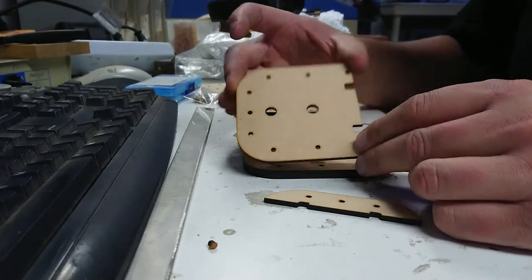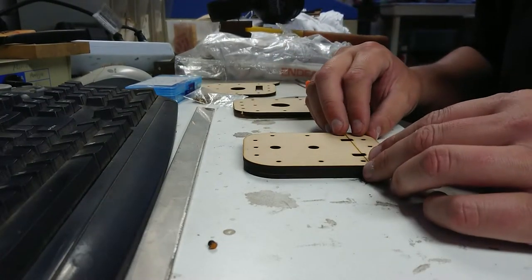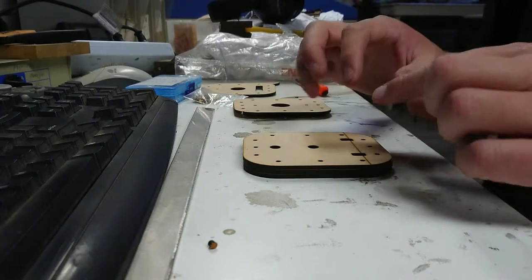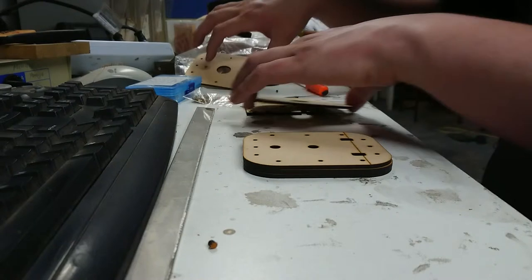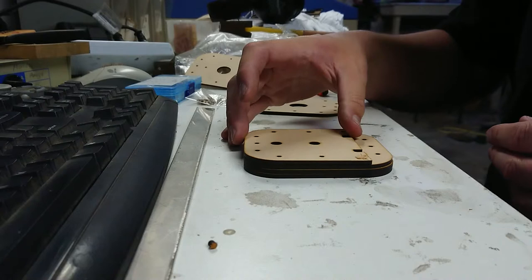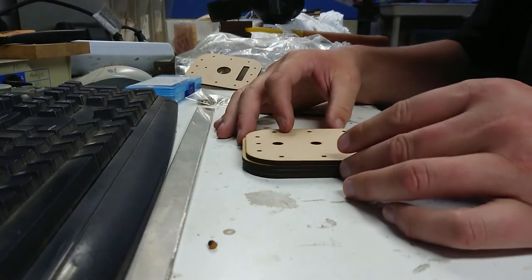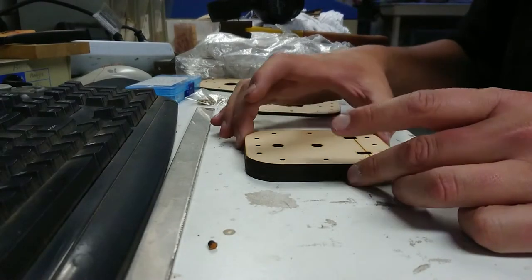It's designed to create the two little posts that will make the little square recess for the belt itself. In previous designs, I've just had a little pillar, and I've laid a piece of wire through it and then bent it round later. I'm trying something new this time. And of course, to meet the thickness of the belt, I need more than one layer there. So that's going to come up. And it's also creating the peg and also the pouring hole to form that.